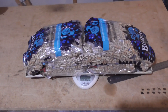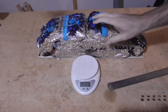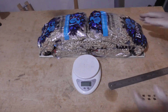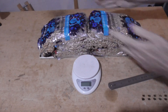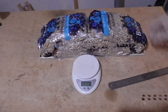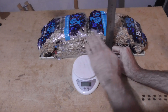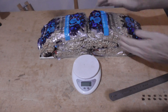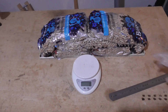The reason that I went with wood pellets for this, by the way, is quite a few reasons. They're easy to measure out in small quantities — you just take one or two pellets out to change it by a gram. And the shape means you can position them just how you want because they kind of squash around, which makes it easier when you're sliding it into the payload bay. As long as the total height doesn't go above fourteen centimeters, it gives you one centimeter of space to squash it upwards as it slides in, so that works out quite well.